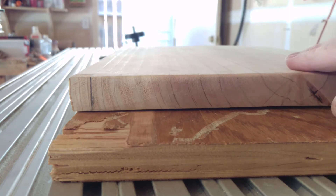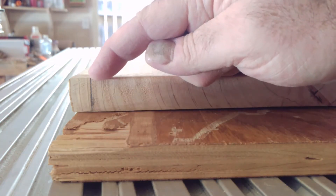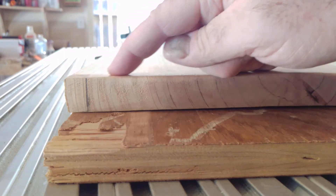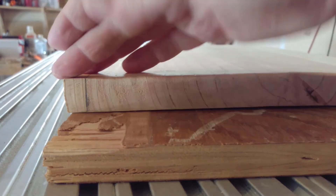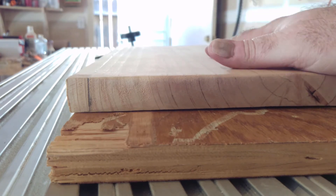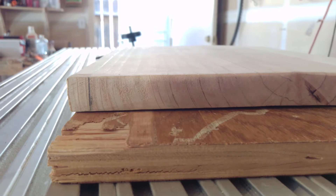If I have to mill a cupped piece, what I do is set my home position about four-tenths of an inch higher than the top of the surface material — whatever my plunge depth is set for. I let the first pass run and it will skim off all the high spots so everything ends up at that height. Then I go back, reset the home position to the actual material surface, and run it again. That way when you get to the middle you don't have all the extra wear and tear from the added material thickness. That's how I deal with cupped wood.